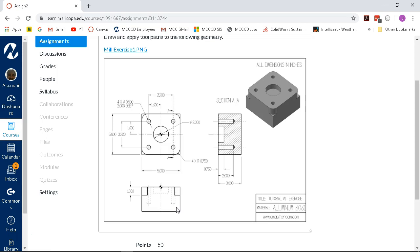Is that going to be acceptable? It's going to be within the 5 thousandths tolerance, but there's going to be a definite witness line that I probably just can't turn this thing over. So at that point, then, am I squaring it up, manual operation, or setting it up to square it up to 5 by 5 by 3 in some other setting? Or are we getting oversized material?